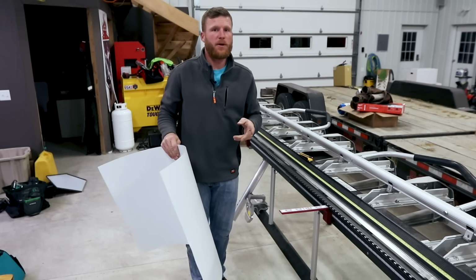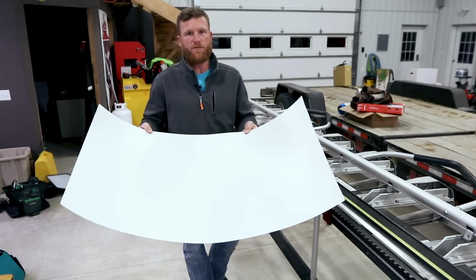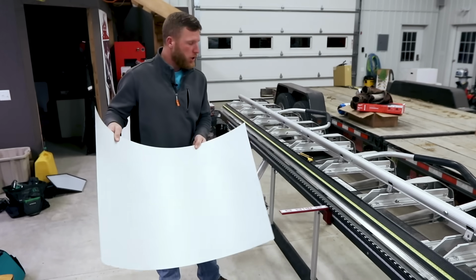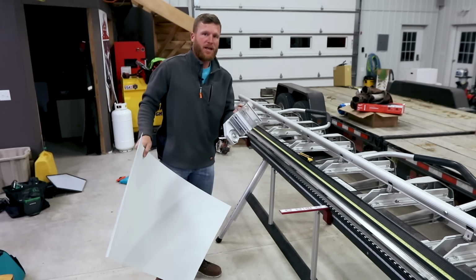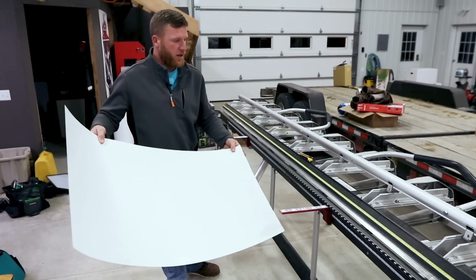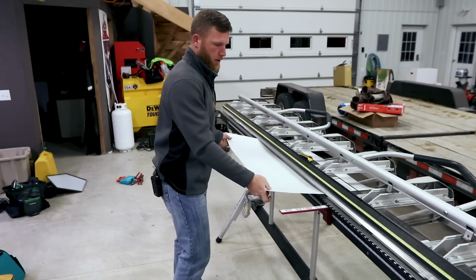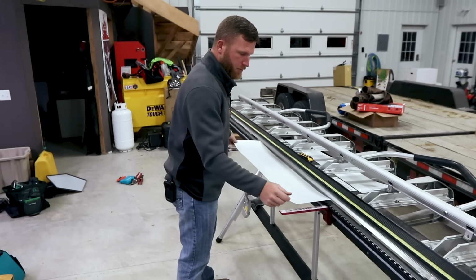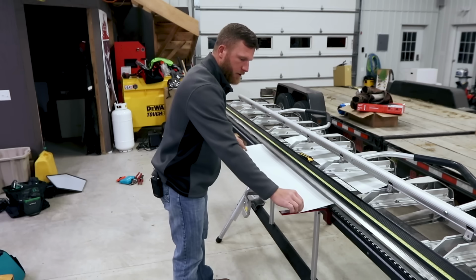All right, so that tip is going to be good when you need to cut your material to length, but what about width? So now I've got this 24-inch piece of coil stock, and you can either use this cutoff wheel, which I will show you in a second, but when I was first starting, I didn't have one of these, and this is what somebody showed me. So you're gonna stick the material in your brake. Since I got these sweet little Just Bend It markers, I'm gonna set it at just some random number, 7 inches.